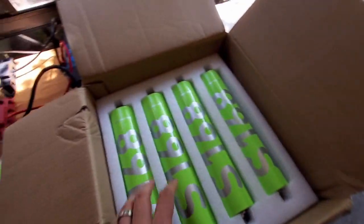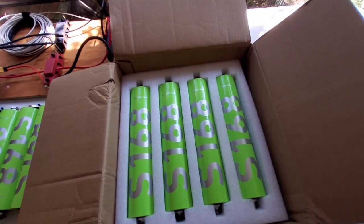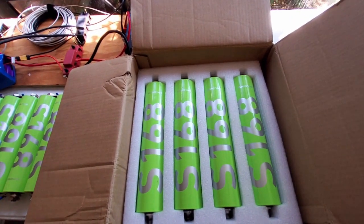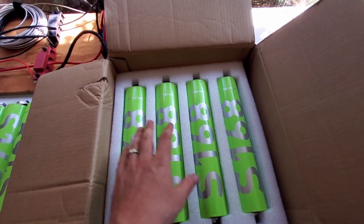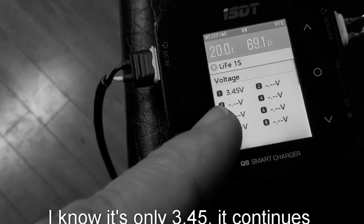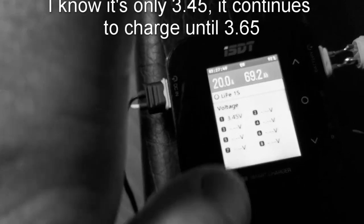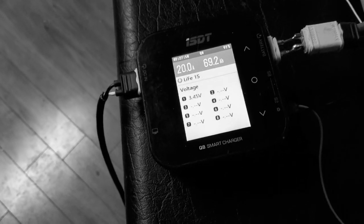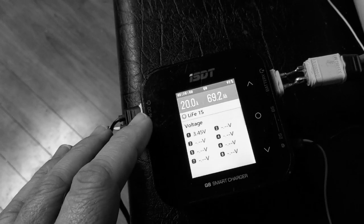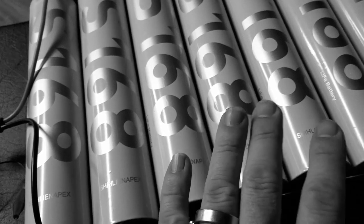This time, I strung this set in parallel and applied a balance charge to them, and I fully charged them in parallel to 3.65V. It's actually pretty close — kind of in that steep knee, about to really ramp up in voltage. I'm using my charger to apply a charge to these cells while they're in parallel and balancing.